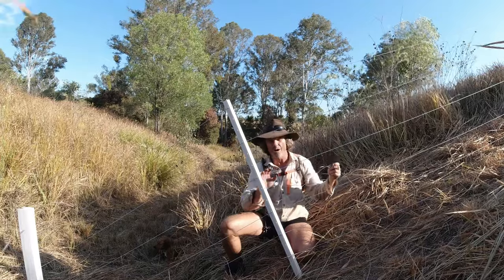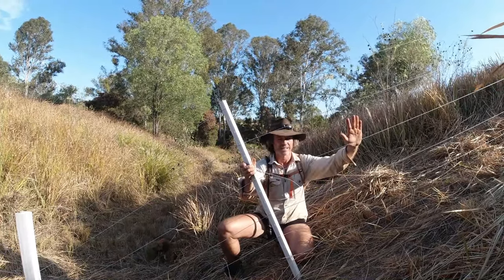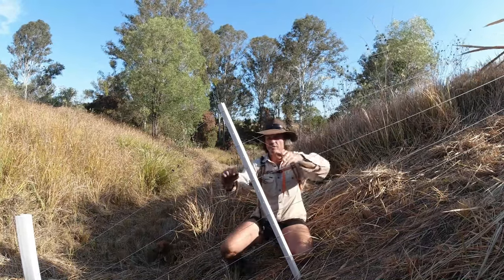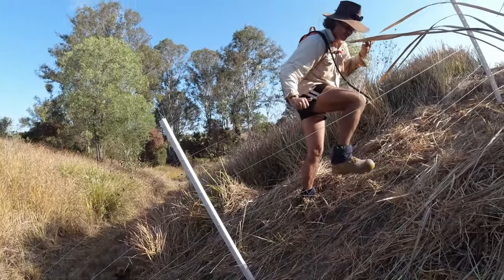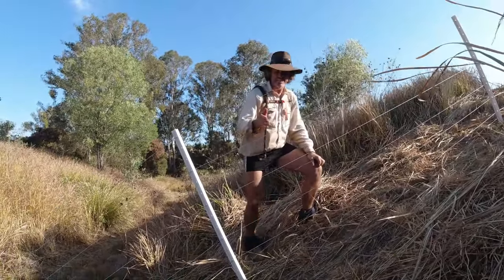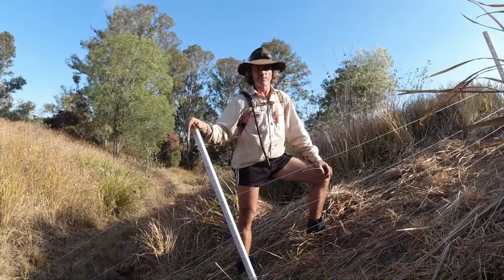Not only is it important for straining wire - when you get animal impact like kangaroos, if you've got all these friction points in your line and an animal or a kangaroo hits it, that line is not free. There's a chance your high-tensile wire is going to snap. With this setup now - if something hits that, it's moving through those holes, moving with the holes. If that was tight, there's no way. That's 1,300 feet and I can stretch that through those holes. If it was tight, it would be catching and breaking your high-tensile wire. That is free-moving - that post is free-moving. It's not catching anywhere and that's what you want. You want an electric fence that moves freely if you have animal impact.